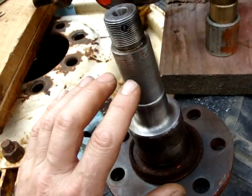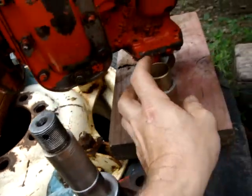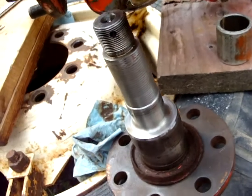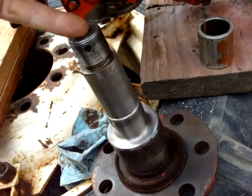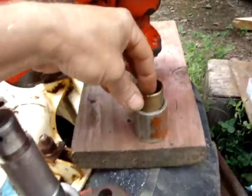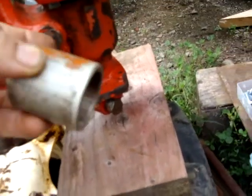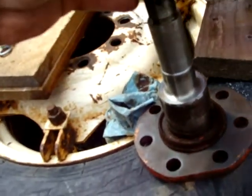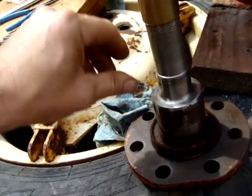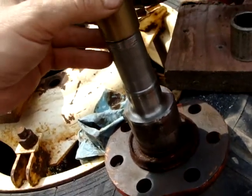This is now at 1.275 inches. I found a bushing that fits the race — this is because I don't have the five hundred dollars for another one of these. That fits there and it just needs to be pressed back into the final drive. But now I have to turn it another 25 thousandths down and hope it doesn't break off, to make that fit — and the guy won't call me back.